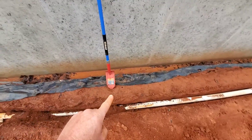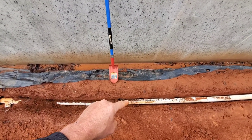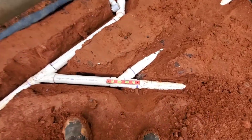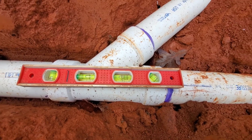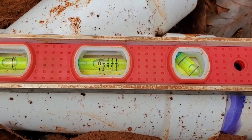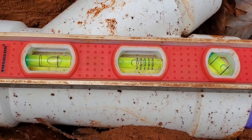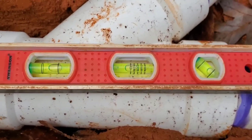Going this way, we've got a nice shovel that's great for horizontal digging, not necessarily vertical, but great especially for horizontal to make these trenches at the right angle so you have a fall so everything's running out properly. A proper angle — on this plumber's ruler you can see — this is the three inch pipe and it needs to be at least an eighth inch or more. This is a quarter inch, and that needs to be the fall to make sure water is draining downhill. On a two inch pipe it would be at least a quarter inch or more, so this is a very important tool to have.